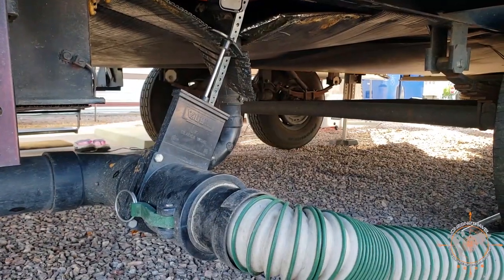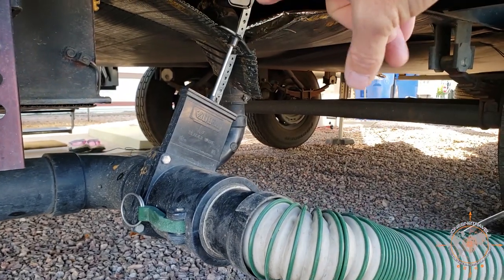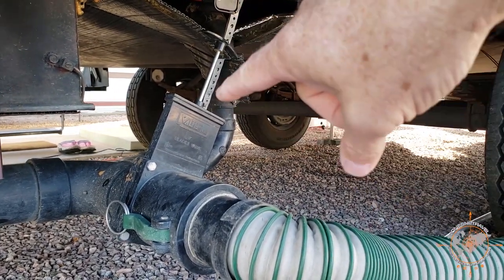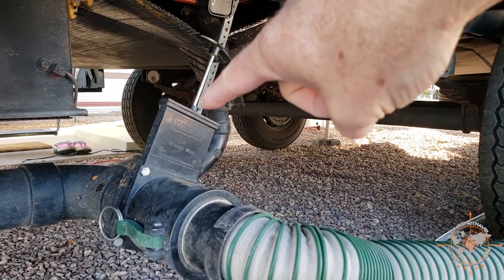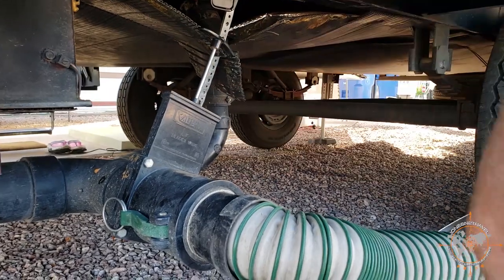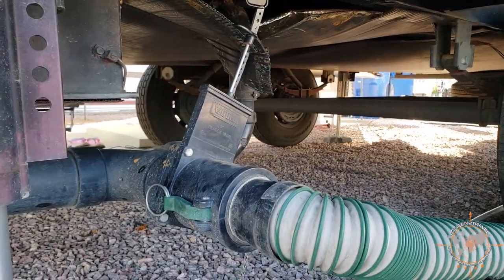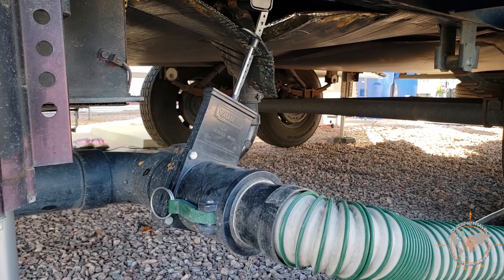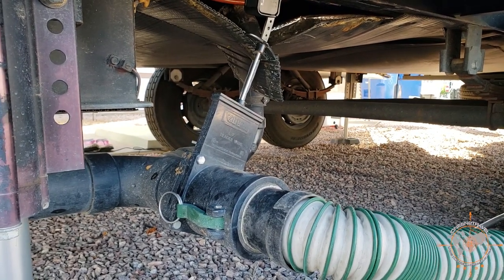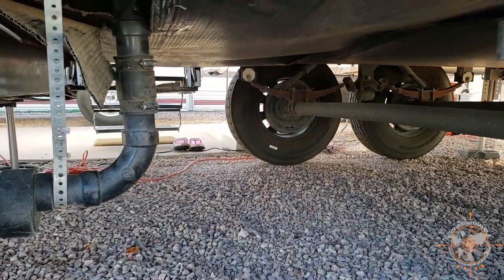I know that because I have an extra valve on the end of where I connect my hose. I installed that so I can close it off — just in case one of my other valves fails, I'm capturing the liquid so when I take the cap off to install the hose, I don't get liquid on my shoe or make a big stinky mess. That's how I know the kitchen valve is not sealing, and that's why I'm going to put new seals in it.